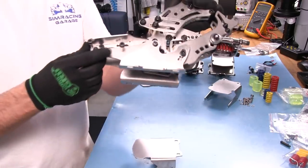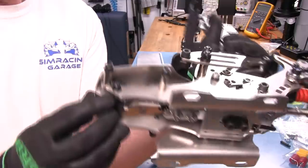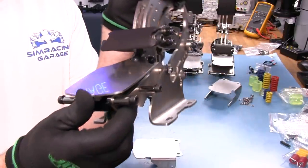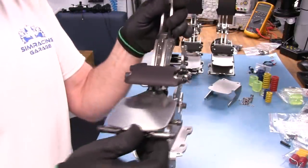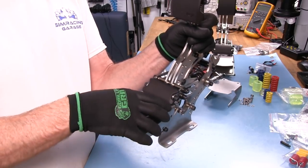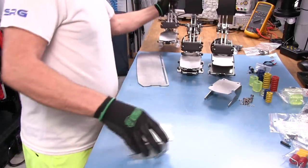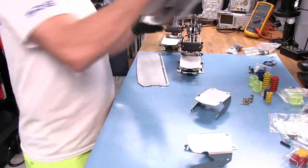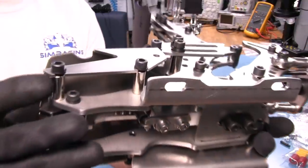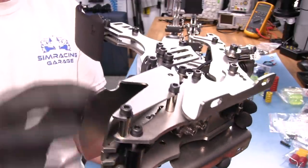There's two bolts down here for that. You can see they're sticking out here. They look to be about 20, 25 millimeter spacers in there with 4mm hex socket head cap bolts on both sides. And this is going to fit on here like this, with these two holes to the front. We just loosen those, and this will slip right down in there. I've already done one to show you. Very simple stuff, really. I didn't want to suffer you guys through me doing it. And you can see this one is now mounted. The only thing you have to be mindful of is you want the washer to be on the outside of the plate when you slide that plate in. Just push the washer up and then it'll slide in.